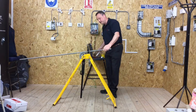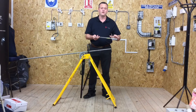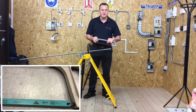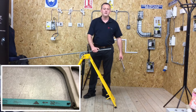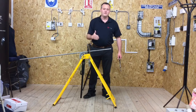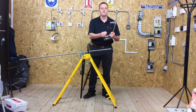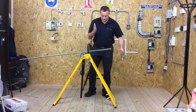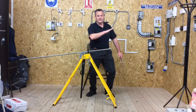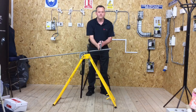I can now cut it to the desired length using my hacksaw. The minimum TPI — teeth per inch — on the blade should be 24, preferably 32. We need lots of teeth when cutting a hard material such as metal, unlike wood where the teeth are far apart. This is a hard material so we need at least 24 TPI. Note that the conduit is set at a slight angle, so it's not horizontal — therefore I cannot cut straight down through it.